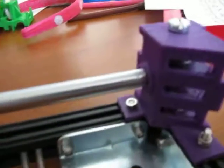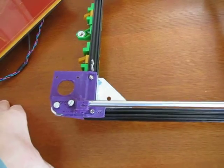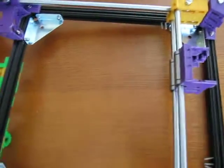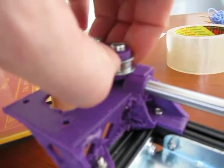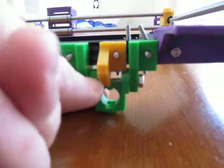As you can see, I've not got separate X and Y rod mount points — they're directly into these plastic pieces. I figured it would be a simpler build rather than having to adjust things, and fortunately these come out accurately which is absolutely fantastic, with no judder as you move it around. I've taken some 20mm M5 one-millimeter washers and made sure there's an 8.5mm space for that to sit in. It's a folding printer, so the M12 rods go through these.